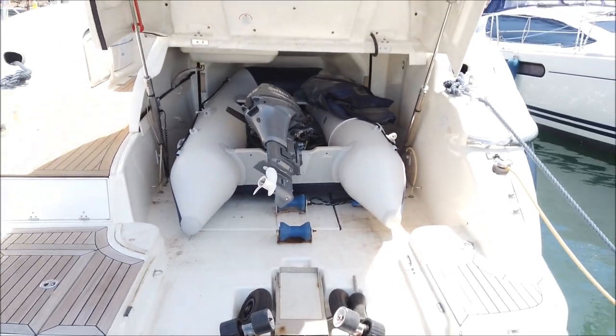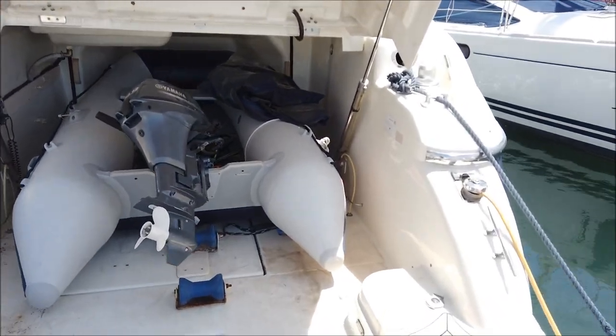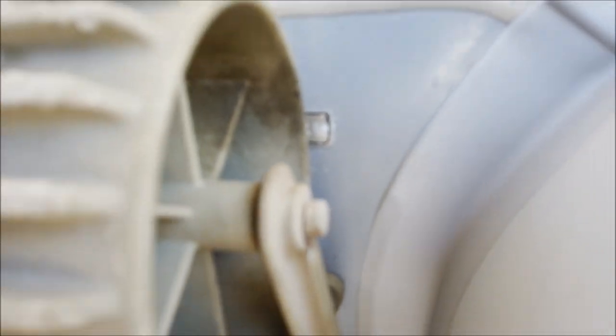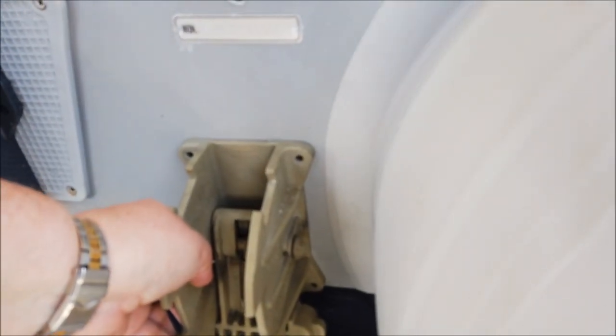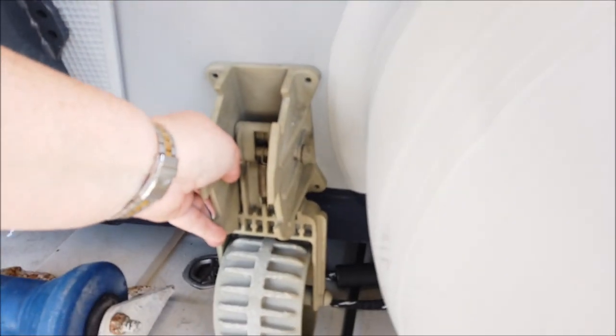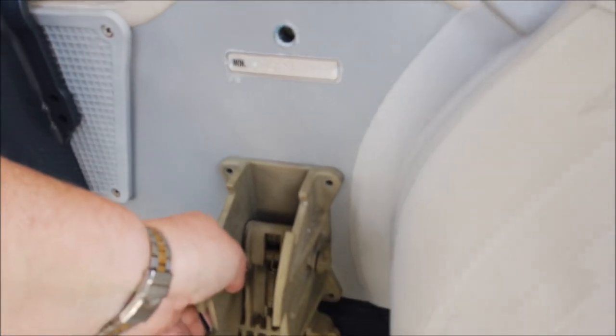So you can see now we've got the garage up and the tender inside. I'll show you where we're going to put these in. Here's the transom - we want to make sure we are clear of the fuel tank here, we can just push that out of the way. You can see where the sponson meets the transom here. Just at the side of that, we're going to be mounting this just there, just above the line where the seal of the floor is. We'll just mark the holes out, drill through, and mount each wheel accordingly.